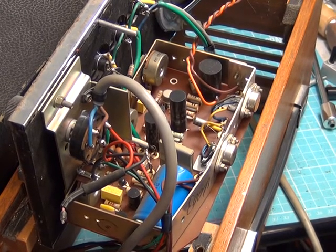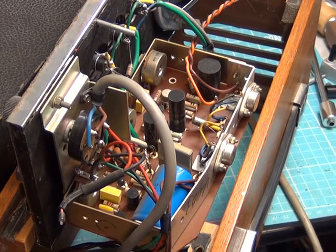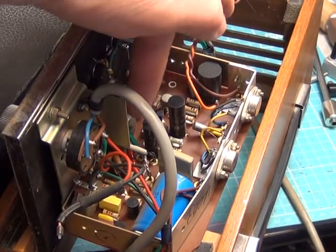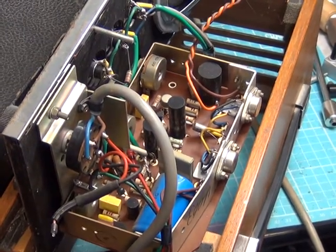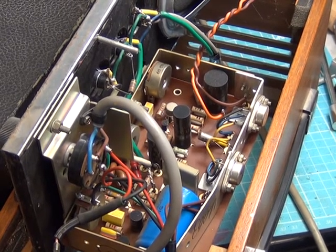I've been taking the four BA nuts off, and as you can see, that's the amplifier module. Now, these black capacitors are always suspect. They weren't that brilliant at the time, and they're certainly not brilliant 40-odd years later. We're going to change everything in there on those electrolytics. We'll get Mr. C to do that, and then we'll put the recorder back on.